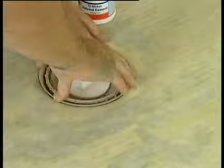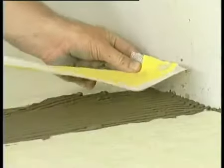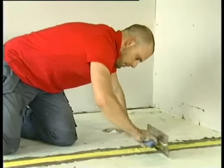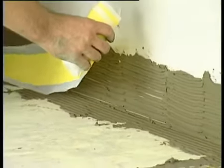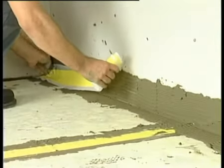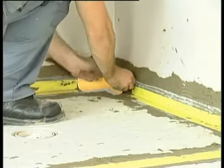Lay the rest of the fleece, avoiding overlap or gaps at the joints. When joining two or more pieces of matting, apply flexible tile adhesive evenly across the joint and apply joining tape over the seam, pressing firmly to ensure a complete bond to the adhesive. Apply flexible tile adhesive along the edge of the wall and the fleece, then apply the joining tape to create a watertight seal between the wall and floor. Apply a thin layer of tile adhesive to the corners of the bathroom and press the pre-formed corners into place, ensuring they are fully bonded.